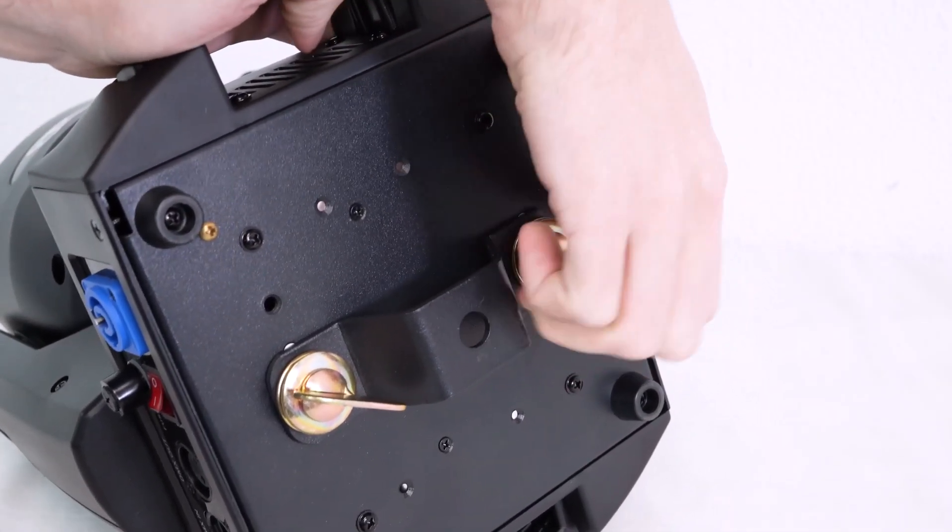If we want more control over our lights, we can set them up to a DMX controller. To start, go to the Address menu for each light and set the DMX address — for today we'll use 001. Use the Up and Down buttons until you see the blue square around the number, press Enter, then use Up and Down to switch between DMX addresses. Press Enter to save the change. Next, go to the Mode menu on each light, set each light to DMX control mode, then go all the way down to Master Slave Choose and press Enter until it reads Slave mode.